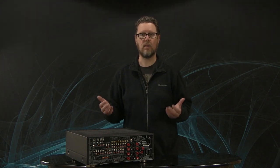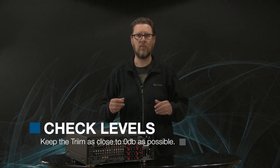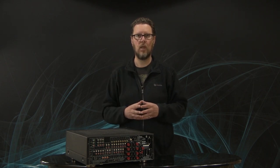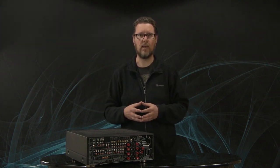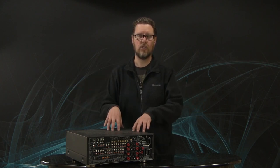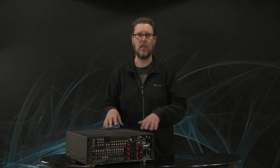The second thing you want to look at is check the levels — check the level adjustment. If all of the levels are above or below the trim level in the speaker settings, make sure that you don't have too much spread. A dB or two from the zero dB trim position is good, but if something looks out of whack and everything is set at like minus six or minus five dB, or plus six or plus eight dB, you want to correct that because you can overdrive or underdrive things. You want to be as close to that neutral zero dB trim setting. Just look at your manual or go online — you'll see what I'm talking about when it comes to the manual speaker setup.